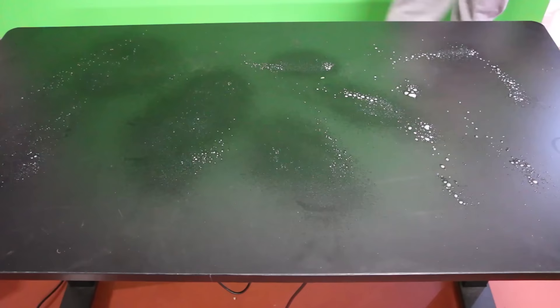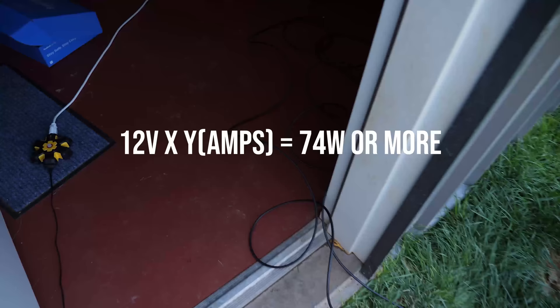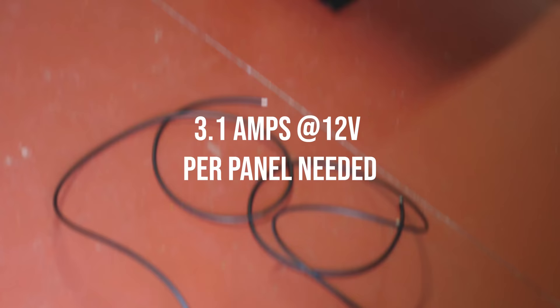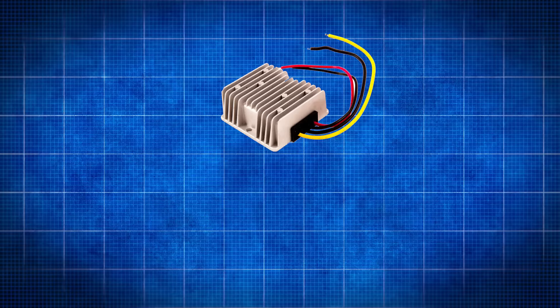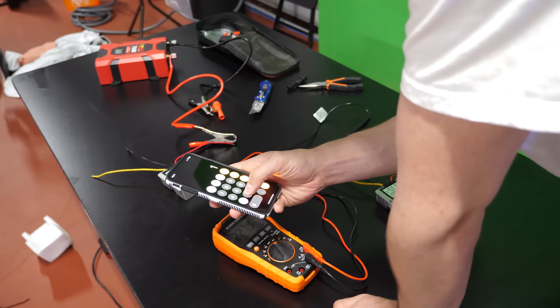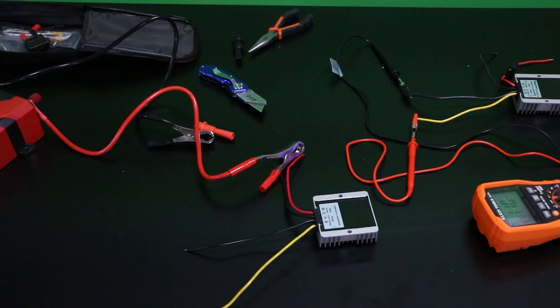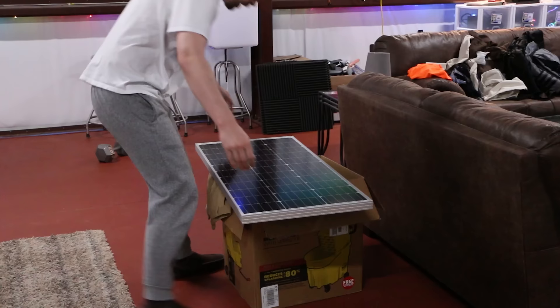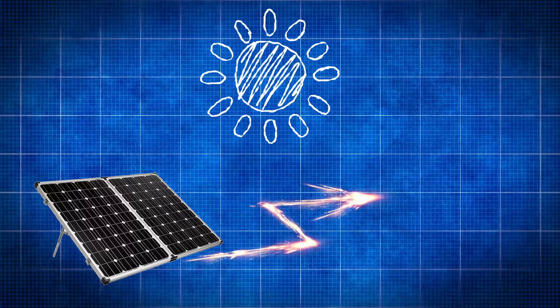With our gaming PC ready to receive 12 volts, we had to make sure our solar panels were going to give out 12 volts at an amperage high enough to produce 74 watts or more. Voltage times amperage is how you calculate your wattage. The solar panels do produce a direct current, but it's a fluctuating voltage and amperage. So we got a buck converter off Amazon, which takes the high fluctuating voltage from the panels and reduces it down to a constant 12 volts. Reading 12.2 volts and almost 3 amps — that's 34 watts. With two panels wired in parallel, that gives us 68 watts, which means at midday with full direct sunlight, we might just have enough power to run our gaming PC at full load.